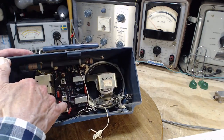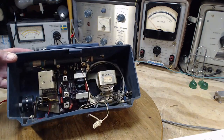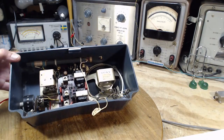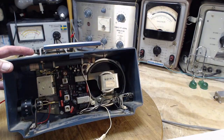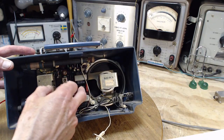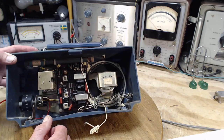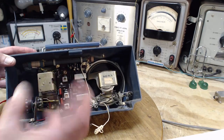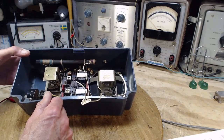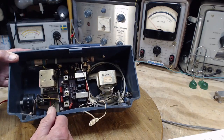Quite a few very small capacitors in here. They all look of the reliable sort. Doesn't necessarily mean they're good, but that means there's a good chance they're good. The other item that's likely to cause distortion is a failed transistor or a resistor that's gone out far enough to throw the operating conditions for one of the transistors out, so it doesn't work quite right.